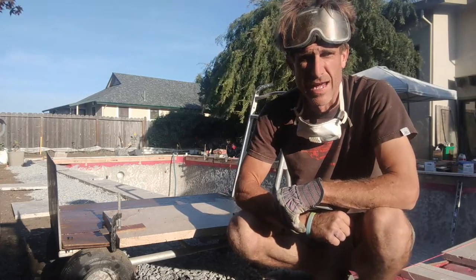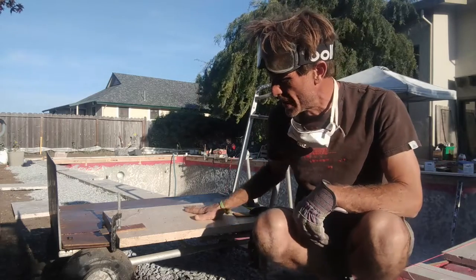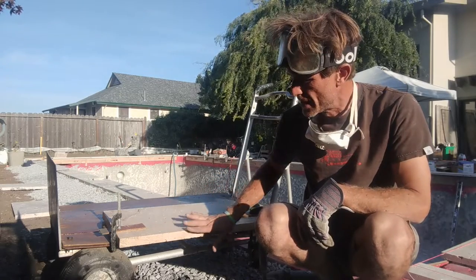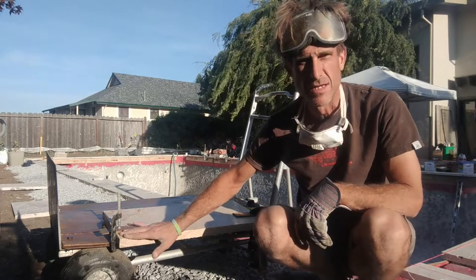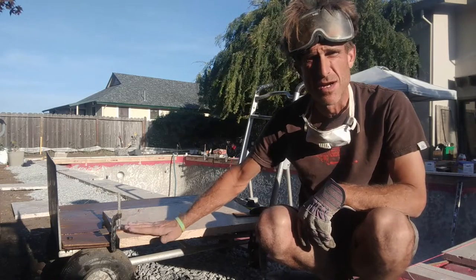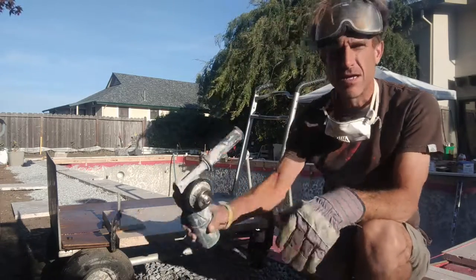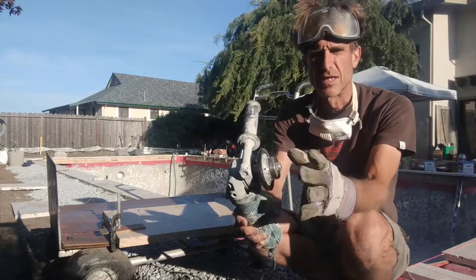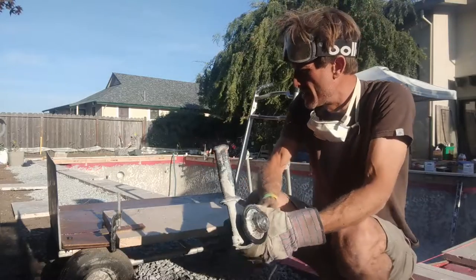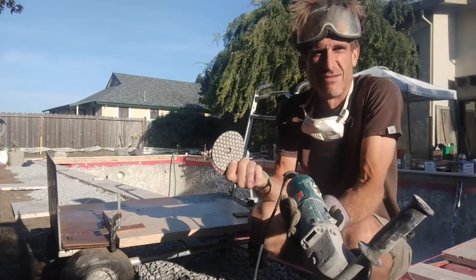Welcome to my first edition of 'Amateurs Using Dangerous Power Tools.' Today we're going to try to bullnose the edge of this travertine tile so that you don't cut your finger on the edge. This is a skill you really need if you're doing a stone project and want a round over or any other profile. We use one of these handy profiler wheels — it has a little bearing so you don't cut too deep — and you just go along the edge, then use a couple of different sizes of sandpaper.